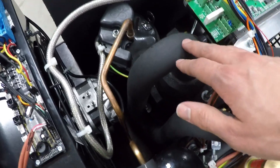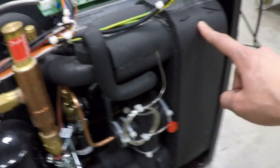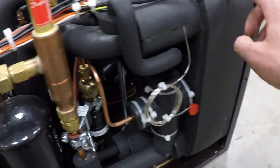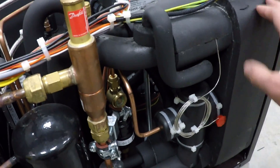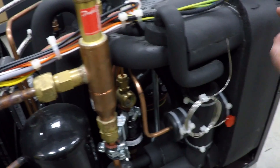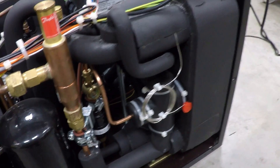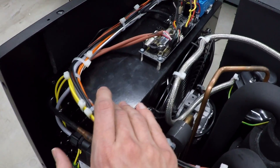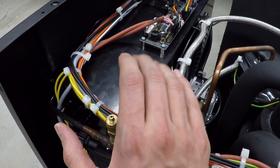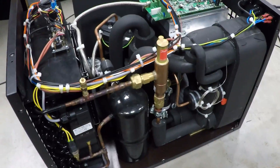The compressor itself is compressing the gas coming from this part, and then the compressed gas — it's not a gas anymore, it's liquid — goes through those pipes here to this part, which is a heat exchanger. It will exchange the heat from the water to the liquid, so when the liquid goes into this part and evaporates, it removes the heat from the water. Then it goes back to this part, which is basically a radiator cooling down the gas, and once it's liquid again it goes back to the compressor to be compressed again — so it's a cycle.